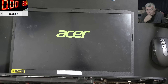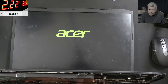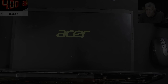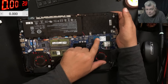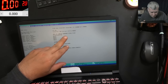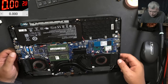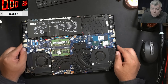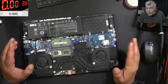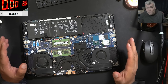It's loading Windows. It's taking no power because I have no power — the laptop wants more than 5 amps. I can unplug and plug back, and at some point it will get disconnected again. The customer's SSD is actually good, but I'm assuming he wiped the drive. It is detected. On this one, to install Windows 11 with this gen CPU, you need a driver for the SSD. I'll ask the customer if he wants Windows or not. But anyway, the laptop is fixed.